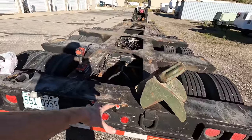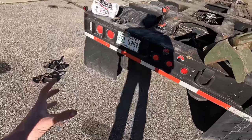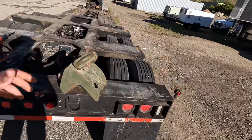Alrighty, folks, I'm gonna work on putting a pintle hitch on the back of this lowboy. I'm doing this because I want to increase stress in my life and try to flat tow the second army truck behind this trailer. So once we have the pintle hitch mounted there, we'll use a tow bar that I got from Alan to connect from the hitch to the bumper of the army truck. And hopefully that's gonna drag the front end around and make it steer along with the trailer.